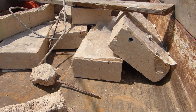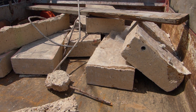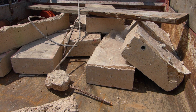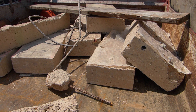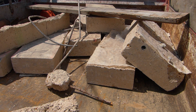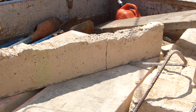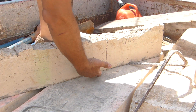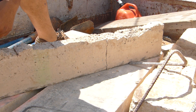I've got a bunch of samples here. I'm going to put them together to help you — I have to stack it first. The details: one of the things I showed you in that video is where I put the machine on top of the crack. What I haven't worked up to yet is to show you that not only is the rebar in tension, but the concrete, even though it's got a full crack in it, is in compression. This has no reinforcement in it, but the rebar is here — I cracked this by mistake; I wanted to use it as part of my samples.